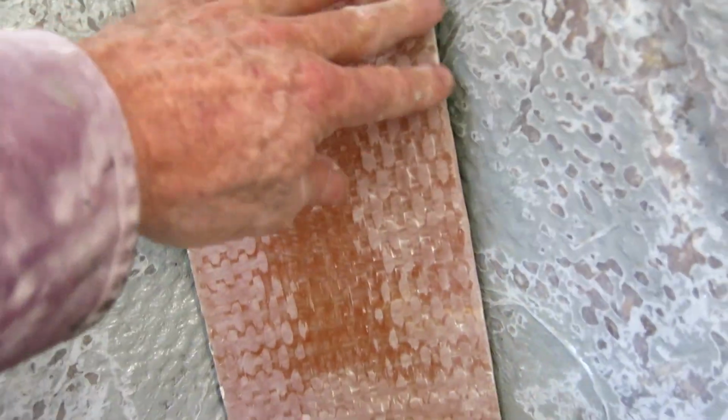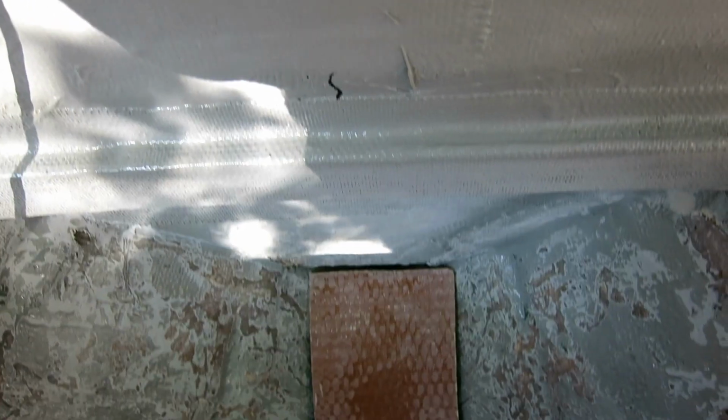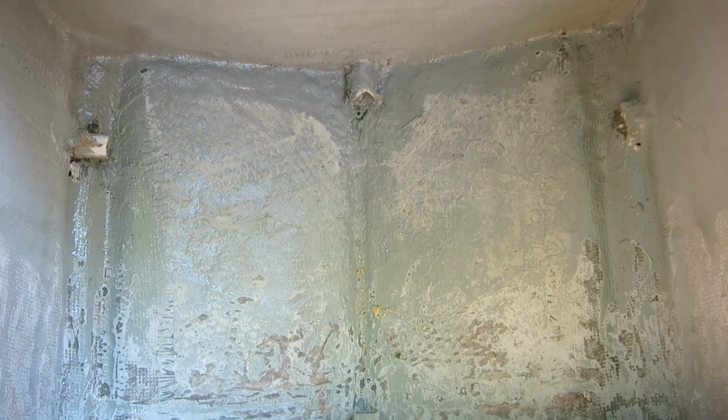And I've got the bottom for the water storage tank cut. Just cut it out of a heavy piece of fiberglass. I'm going to put it in here like so. Glass it in place. And that way the water from it, wherever, can drain under it. Whatever water can drain under the storage ice chest here in this pipe, and it will get to the low point of the boat, and that's where the sump pump will be, and the batteries.